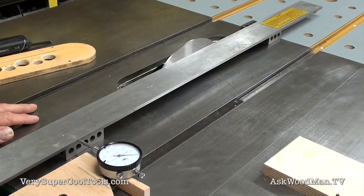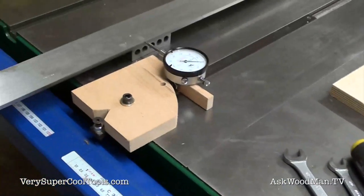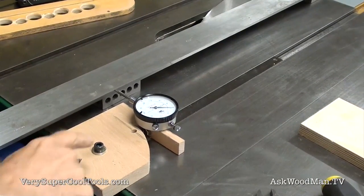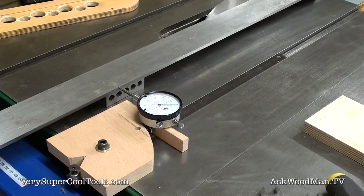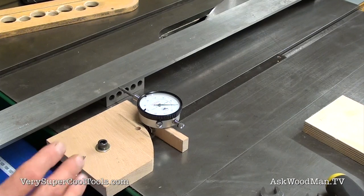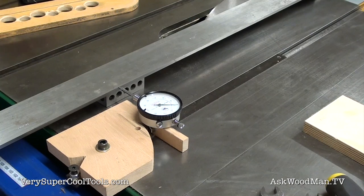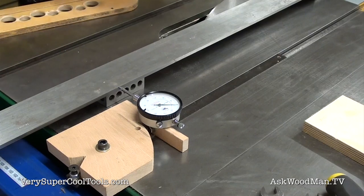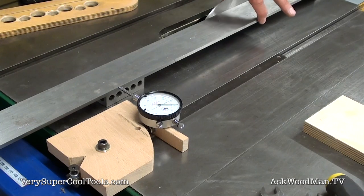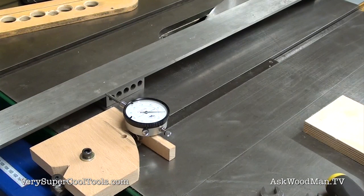I've got a shop-made setup here that attaches to my miter gauge bar — just a block I've used for years that bolts down to it with a locating pin — and I rigged up a way to hold my dial indicator. This is nothing fancy; you don't need a fancy dial indicator for this, but you do need a really good straight edge. I have it set up on 1-2-3 blocks at working height. This is a precision plate that's pretty flat, pinned up against the arbor, and I'm running the dial indicator back and forth — I'm within seven-tenths of a thousandth of an inch over the full travel. That's certainly good enough for me. It was way out before — ten thousandths out — so it had really taken a shock.